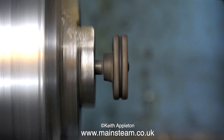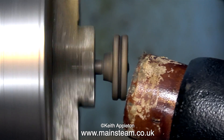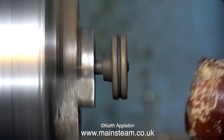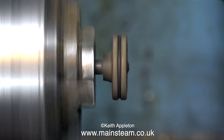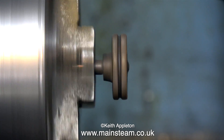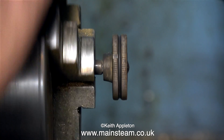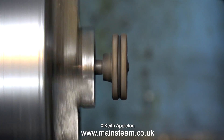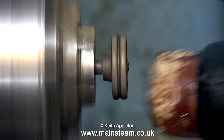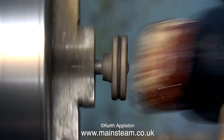Be very careful for a couple of obvious reasons, and don't use the copper side of the hammer — use the hide side of the hammer. The couple of reasons are: if you miss the part and hit the chuck, then the chuck might throw the hammer at you, which is not a good idea. I've done a lot of this, so I'm well practised in the art of straightening things that are not straight by putting them in the chuck and hitting them with a soft hammer. Before any experts write in, I'm doing it wrong for the video. And here, as you can see, nothing much is happening — I'm hitting it a lot of times in the wrong place.